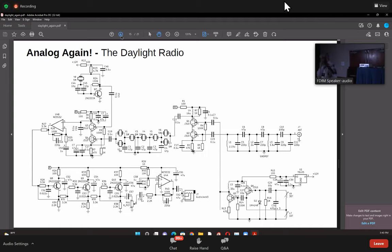So that's the thing. The only problem with this entire circuit is that what you're getting out here is about minus 20 dBm. That is about 50 millivolts. That's all, right? You require this to go up to, let's say, 5-watt level. So the first thing that you do is amplify it up, and the signal is low enough that you can use an RC coupled termination insensitive amplifier, which is what this is, followed by a two-stage driver to the IRF510.